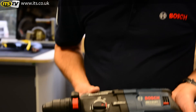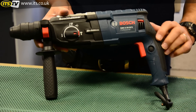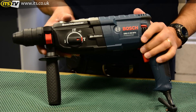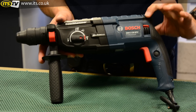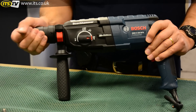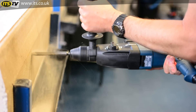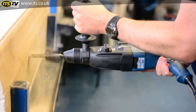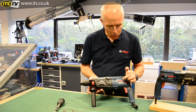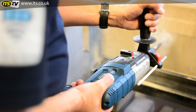It has variable speed of course, and we also have rotating brush reverse — worthy of mention. The carbon brushes are moved to the appropriate position for forward or reverse rotation, which means the tool is as powerful in reverse as it is in forward. This is useful for hauling out stuck drill bits, or for heavy duty screw driving — yes, you can drive screws with this hammer, and it will have lots of torque for loosening larger screws as well. So it's a really good all-round, very high spec tool: 3.2 joules, 28mm maximum diameter in concrete. That's the Bosch GBH228DFV 3-mode professional rotary hammer.